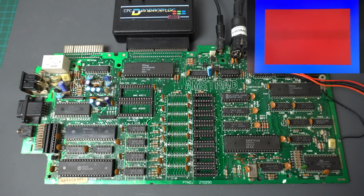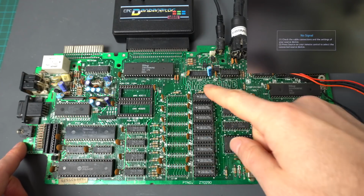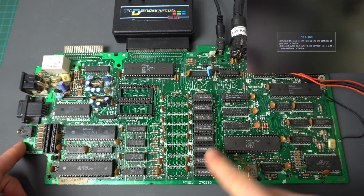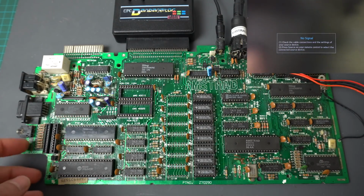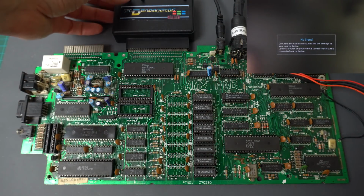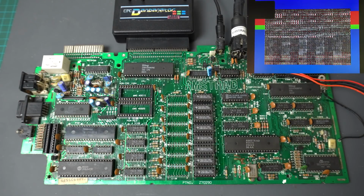So we can put the RAM back in place now. Okay, I've loaded it up with RAM, and this is the lower bank. So that's the bank that gets used in the memory test. So let's see what we get now. I need to press that button. And oh. So this tells us that looks like 2 of the chips are working and the rest are all failing.